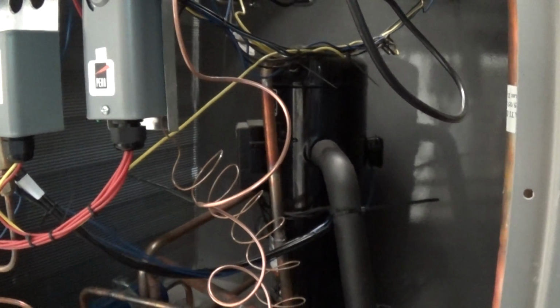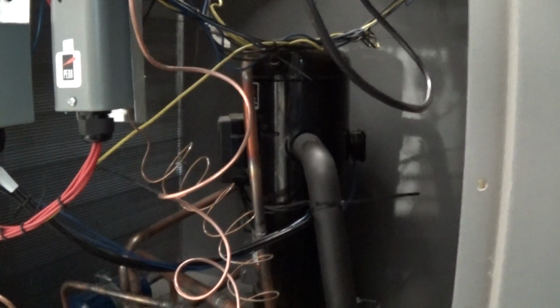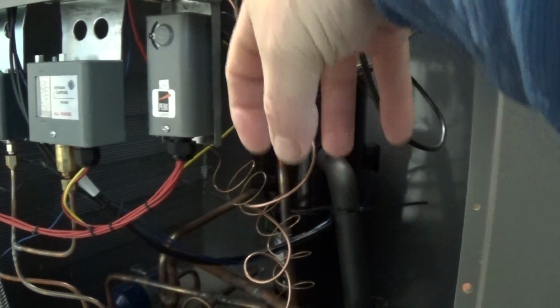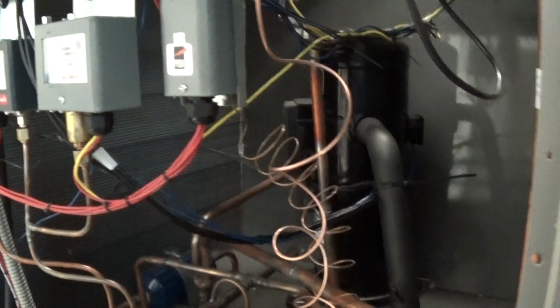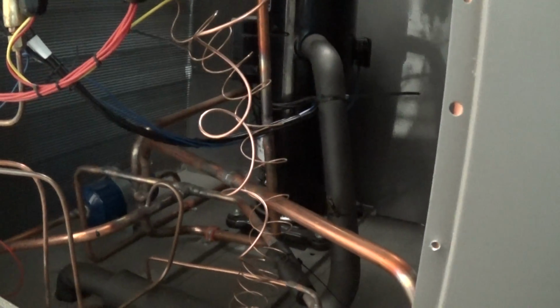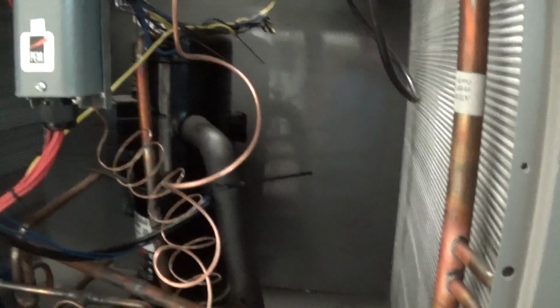The way this works inside is it's almost like a solenoid in there, and a scroll compressor has the bottom movable section of the scroll. The upper section of the scroll compressor is fixed, yet on the Ultratech that actually moves up and down on a solenoid, and by moving up and down you're basically bypassing more of the gas in there, which is how we get the capacity control. If you Google or ask us for information on the Ultratech, it's really a slick design.